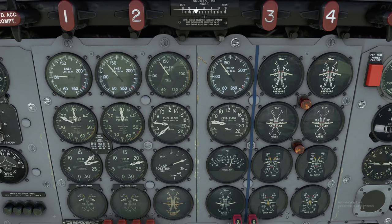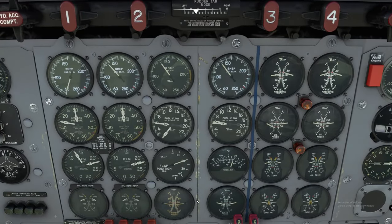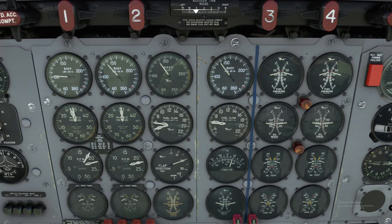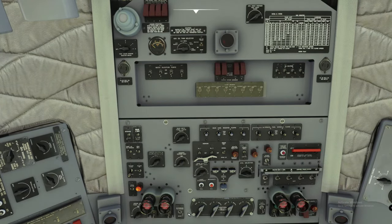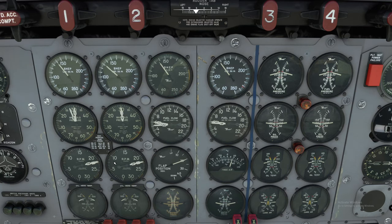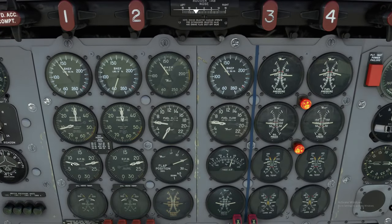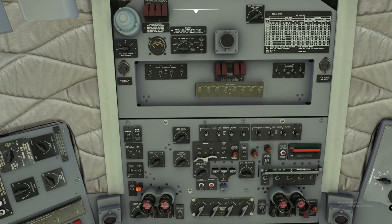Let's reduce our manifold pressure on one down. You'll notice the RPM drop way down — the feathering system works. The RPM has started to increase, so we can bring it back up to 30. We want to go ahead and do that for each of the engines, so we'll go down here and hit reset, back up into the on position. We're going to check out number two right now — bring it down once it hits below 70. There it comes — it came on. We're going to check our RPM, and the RPM is starting to increase now.